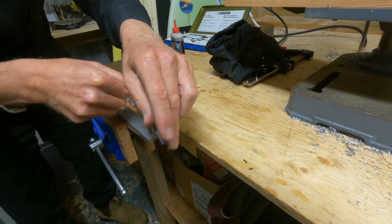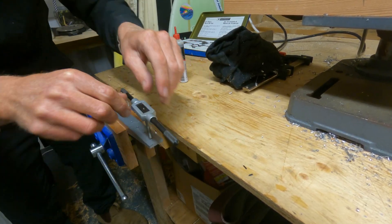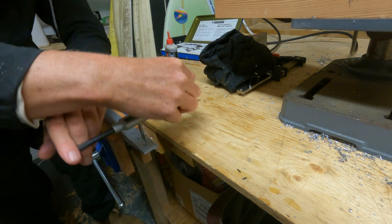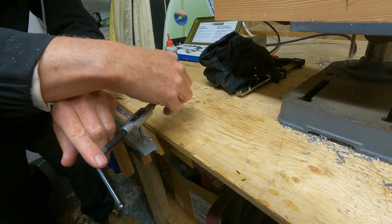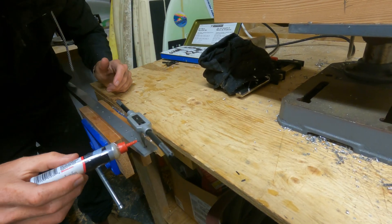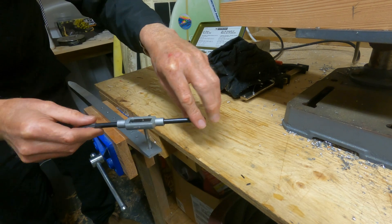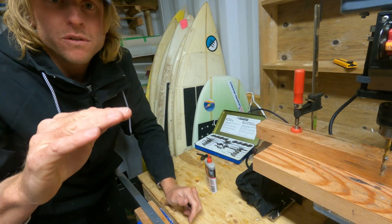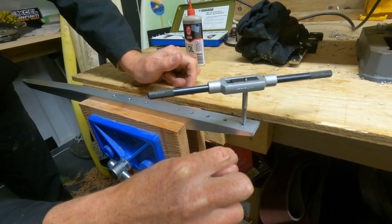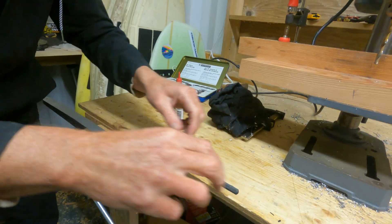Metal fabricators can actually do this using a drill press and get it done really quickly, but I still do it by hand. So just backwards and forwards — you can feel when it's starting to bind a little more, then add a bit more lubricant. One of the reasons we machined the fuselage first is to create a thinner profile so we don't have to tap all the way through an inch. You can see the tap is just protruding very slightly now, so we're nearly there — but you want to make sure you go all the way through.